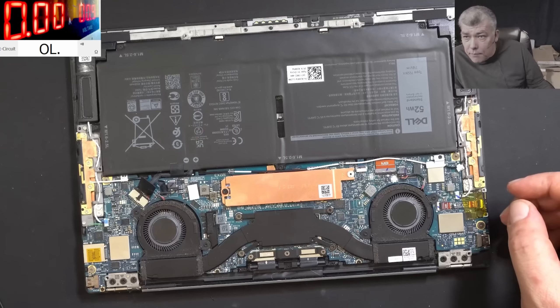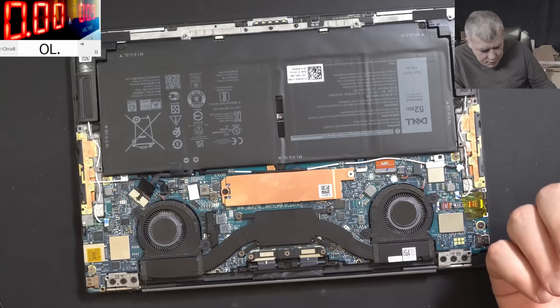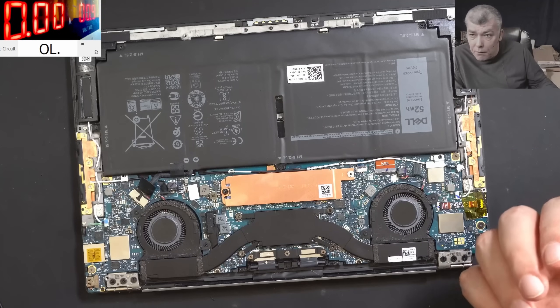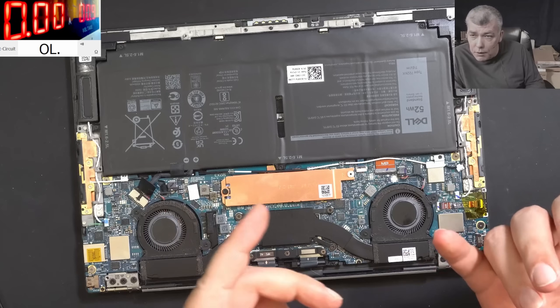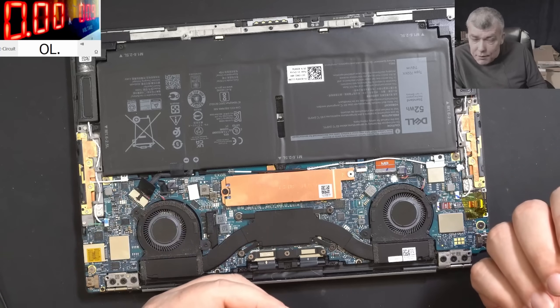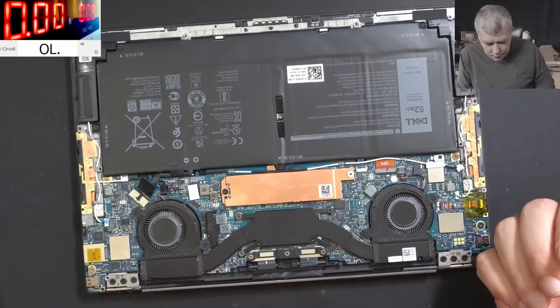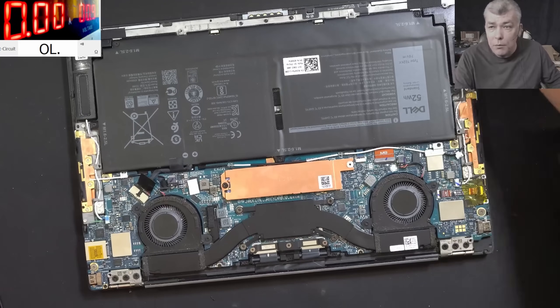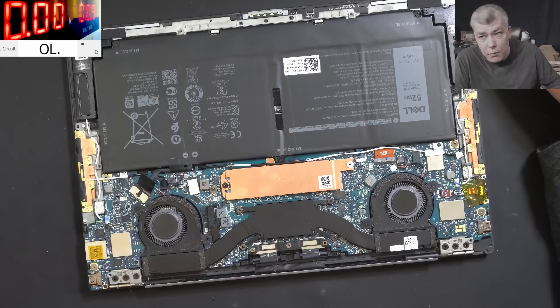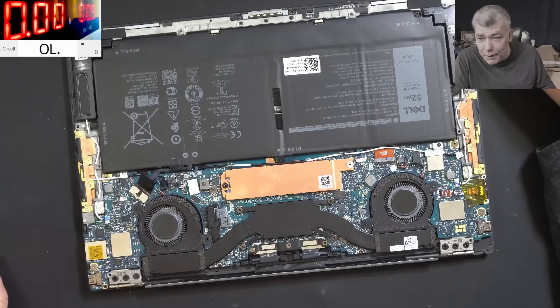Now just have in mind, it's the parts you check when you are looking to fix a laptop. First, the main power rail — if it's not shorted and you have voltage, then if the main power rail is present, the next step is checking the 3.3 volts. And the easiest way to check the 3.3 is on the power button. So I'm gonna stop now — thank you for watching, subscribe if you like the video, and see you on the next one. Bye.